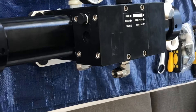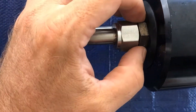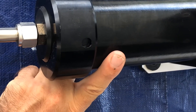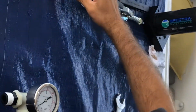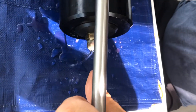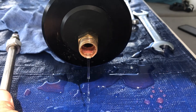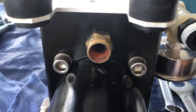Now we are going to remove the J fitting from the Clark pump and we're going to replace the nickel bronze fitting as well. We're going to check if the cylinders are scored, and if they are, I'm going to use this honing tool to make them smooth again and replace the pistons. Removing the J fitting from the Clark pump — some corrosion, not as bad as on the membrane or pressure vessel, but nevertheless we are going to replace these pressure fittings.